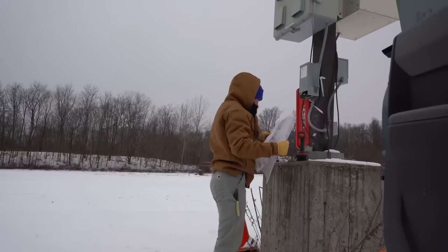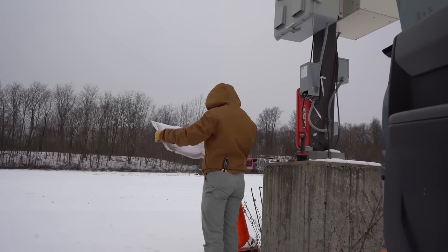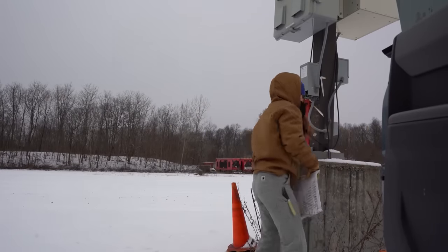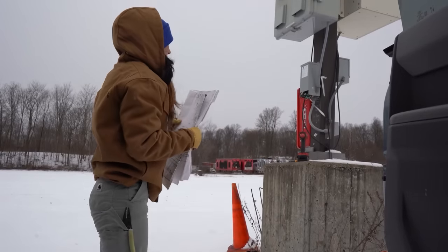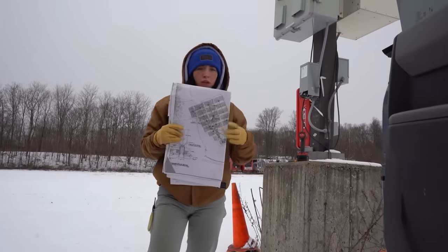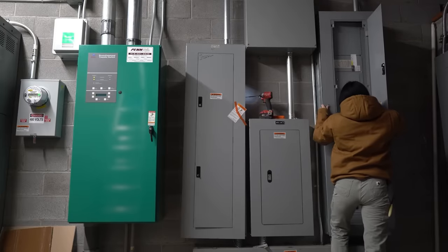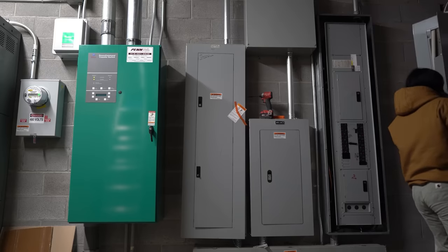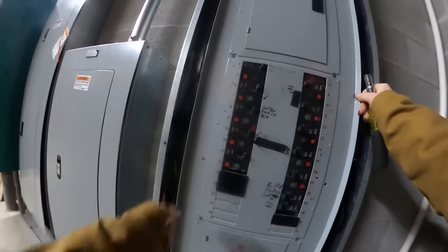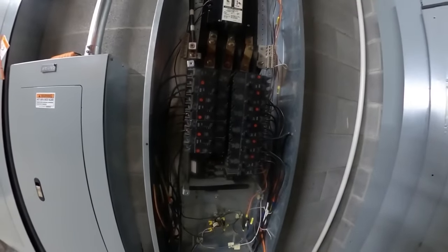This hole goes to pull box seven which is over there. I think my best bet is to first check if any breakers are off. I'll hook up my advanced circuit tracer and leave it here so I'll know right away if there's a tripped breaker and which one it is — because with this many poles out there's probably more than one. The problem is none of these breakers are labeled, and if there is a break the circuit tracer won't signal all the way to the panel. Whoever did this did a poor job at labeling. Also, there's a lot of snow on the ground, which makes it very difficult to find manholes.